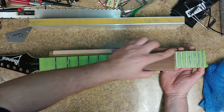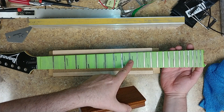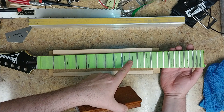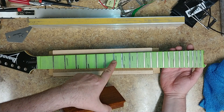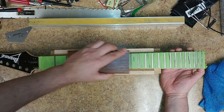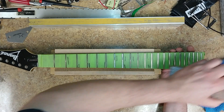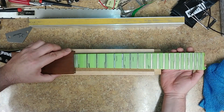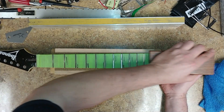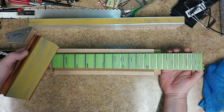These last three I'm noticing over here are still a little iffy. The little black line that was real narrow towards the center is starting to open up — this one's opened up, this one's a little bit opened up, and that one still has a little ways to go. The 320 is not cutting this really fast; it's taking a good length of time. But this is the way I wanted it. Once I start seeing metal on these three, I'm done.